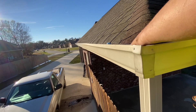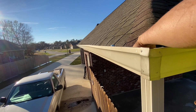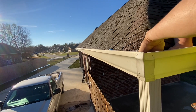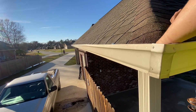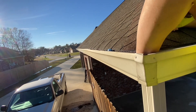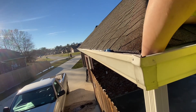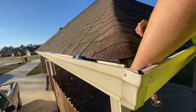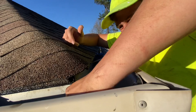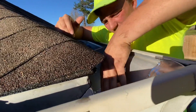The ideal thing is to get it clean and dry. That's where the $30 repair cost comes in, because you may have to get up there and flush it with some water, then brush it out or blow it out with air. Especially if you're out there cleaning gutters on a residence and you notice a leak, you can always double back the next day and catch some of these repairs.